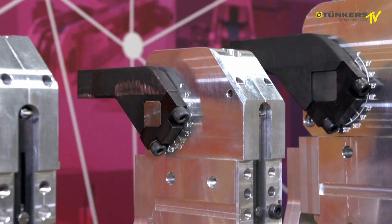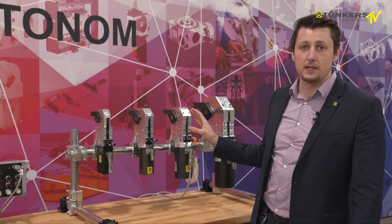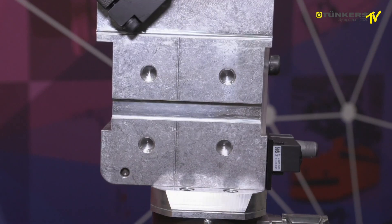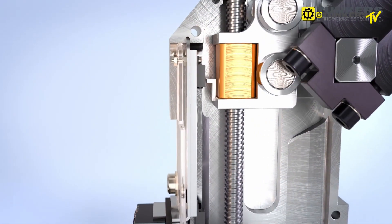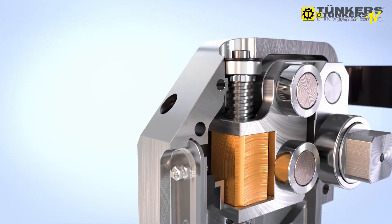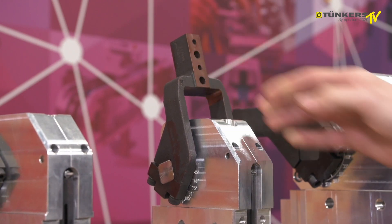You can see the usual system integrated in an encapsulated housing and we still have the same connections, meaning the clamp arm is the same as in conventional clamps, with connections on the front and rear and the well-known inductive T12 sensor systems on the rear. Instead of a piston rod, we have installed a trapezoidal spindle, which has the main advantage of self-locking irrespective of position — the clamp will be locked in each position.